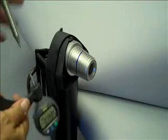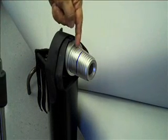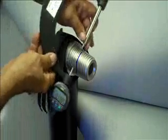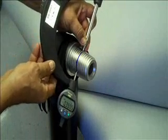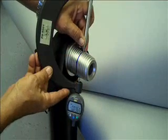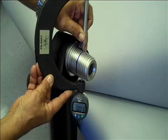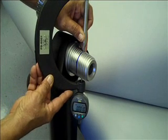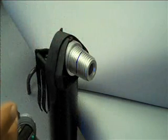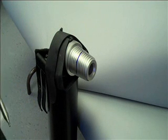It's always easier doing it inside the lathe because the lathe will be holding onto the part. My mark that I scribe down the crest of the threads is at about 1 o'clock. I take the fixed contact point and set it at that mark. The movable will follow the blue line down the taper, and I'm pivoting about the fixed point until I get to my lowest reading. And this one is a +1. Pitch diameter for a pin thread is +2 to -1. And that's all it is to measuring the pitch diameter.